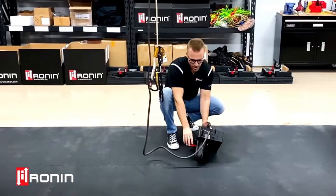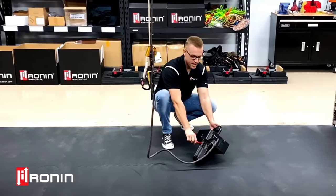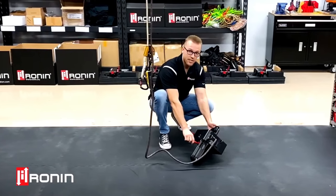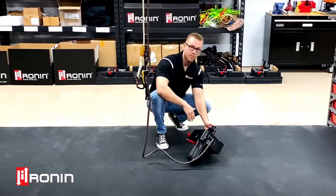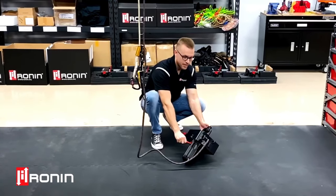Once you're there, go ahead and take your red brake handle and just crack it open just a little bit. You don't want to hold it all the way open for units that have to reverse, as this will actually reverse the rope back out of the system. So just pull it down a little bit and roll the thumb wheel down slowly.